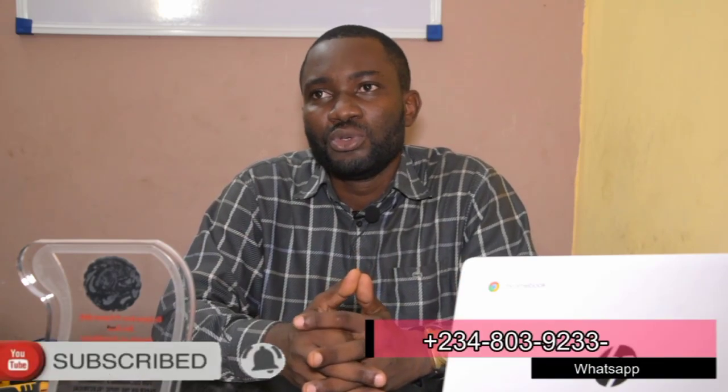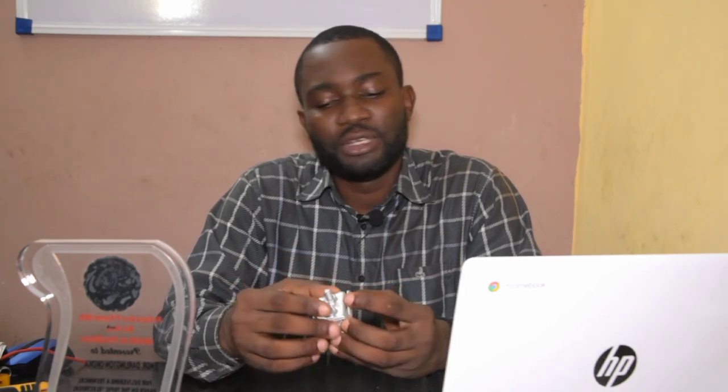If it's inevitable that you have to connect aluminum and copper together, there are specific connectors you are supposed to use — called copper-to-aluminum connectors. Here is one that is majorly used on site. If you look at it properly, you'll see that one part is copper and the other part is aluminum. It has been built to withstand the differential expansion rate, so when the aluminum expands it doesn't affect the copper, and vice versa.